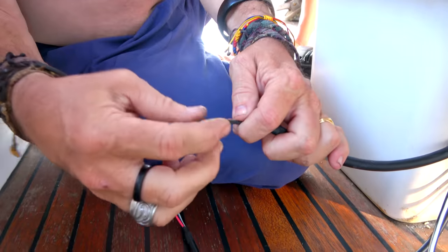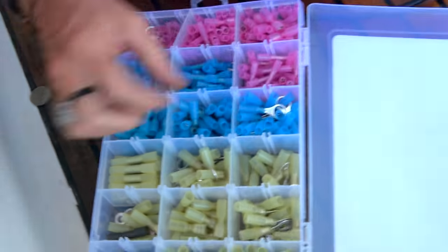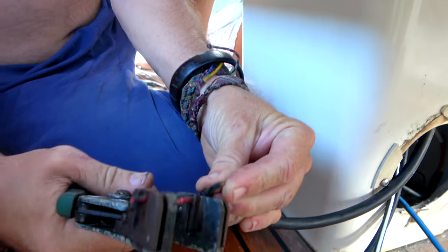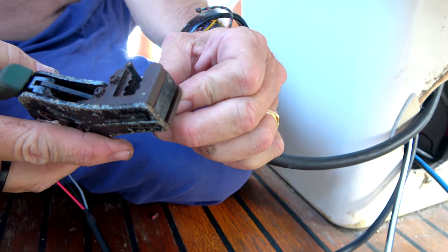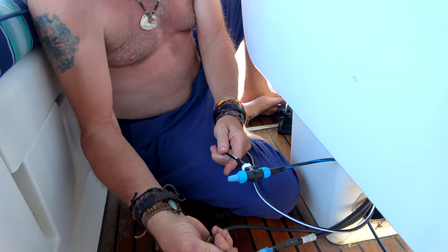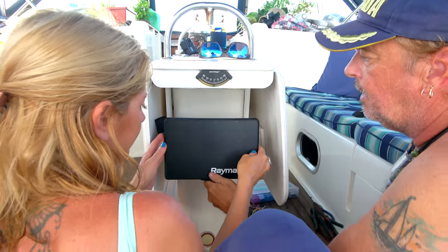We need a couple of connectors — we're going to refresh these connections a little bit, strip back a little bit of fresh wire to get rid of the old gummy electrical tape. These are the heat-shrink type connectors, so once you've crimped them on you can use your heat source to melt it down and it seals itself around your wire. A good set of crimpers is very important — put as much pressure on it as you can. That is our basic connection: we've got our SeaTalk system hooked up and our power circuit hooked up. Tighten this down, pull this off.